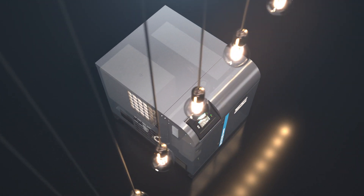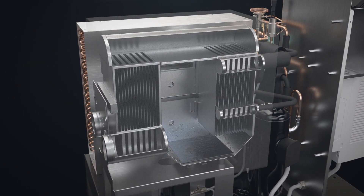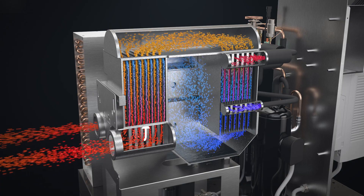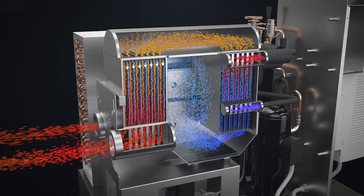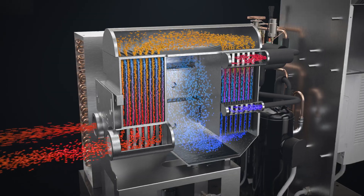Here's how the FD-VSD works. The FD is a refrigerant dryer, which means it removes the humidity from compressed air by using a refrigerant gas. First, the incoming air passes through the air-to-air heat exchanger, where it undergoes a first cooling by the dry, cold air that is leaving the dryer. Although this process inherently comes with a pressure drop, the FD was designed specifically to eliminate any inefficiencies.